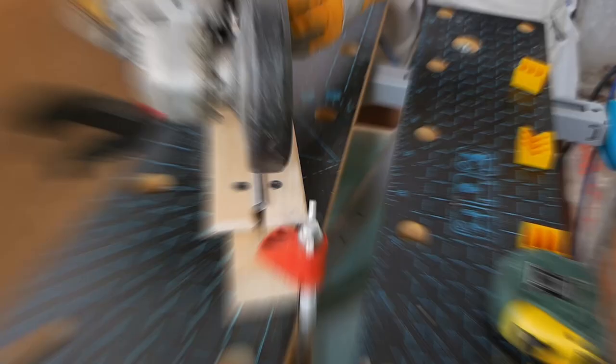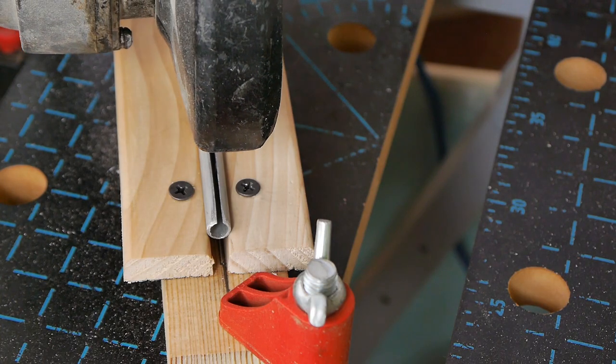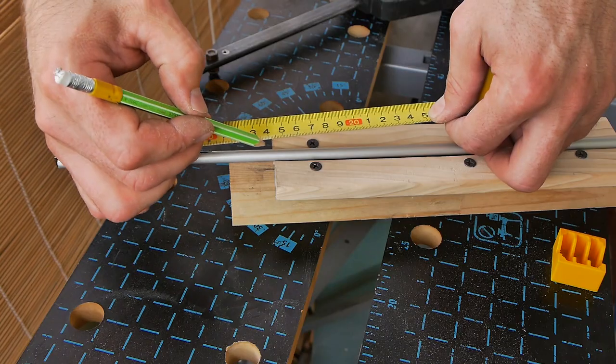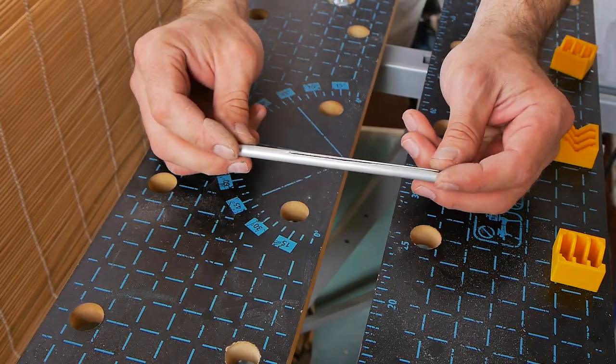For the first homemade we need to make a cut in the tube. Here you can take a thicker wheel — I have one millimeter and consequently it was necessary to expand the cut a little. The cut is 10 centimeters long. We measure another four and cut them off with the angle grinder. Remove the break-off pips — that's what we got.